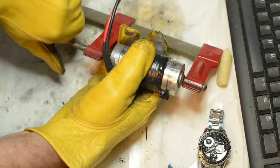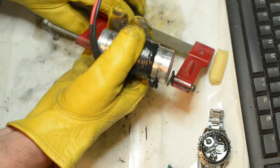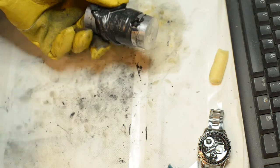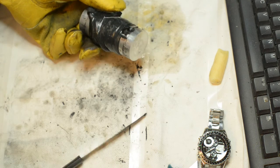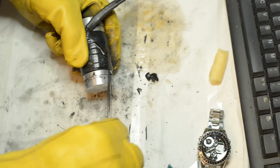It's important to realize the initial temperature of the mold should be around room temperature in order to maximize the length of time 150 watts can be applied to it without unduly cooling its contents. This forms the basis for the time constraints during the first stage of the curing process, which primarily serve to protect the coil windings themselves.